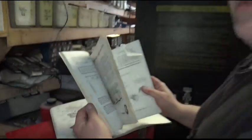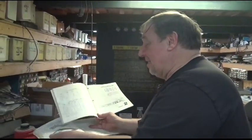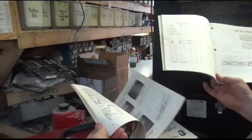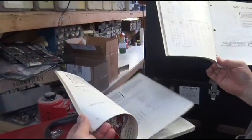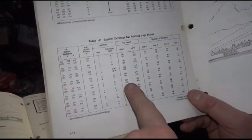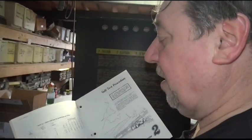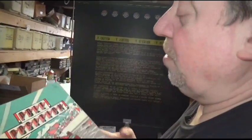We threw this manual in the bottom of the Pole Position so he'd be able to do it. Here's another thing that the first printing doesn't have. It has standard dip switch settings, all standard stuff. Now I'm not going to find it. Here we are. But it doesn't tell you that you can also change the speed limit. Oh, speed limit. So you can have 225 miles an hour, which is what it's set at, but you can actually raise the speed to 244 miles an hour. So all this can be adjusted. It's really clever stuff. You can also change the qualifying time. So the fifth printing is the one to get. That's the most filling information for Pole Position.